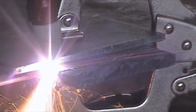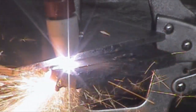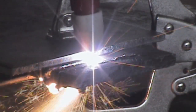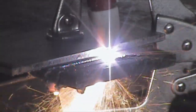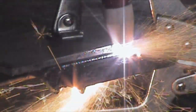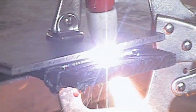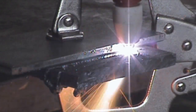At 40 amps I couldn't get through the piece of 3/8ths plate, with a lot of slag coming off it. Now we've got it up to 50 amps on the same piece of plate and you'll still see a ton of metal dripping off the bottom. The machine says it's rated at 1-inch severance, and you're going to see that we can't get anywhere near 1 inch. Either the tip is bad or I've got the pressure set incorrectly. If you go too fast you suddenly get a face full of sparks, which is really annoying.